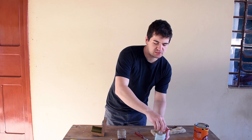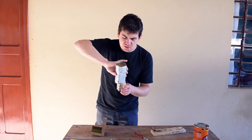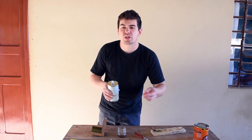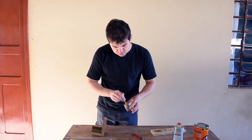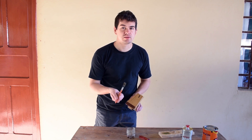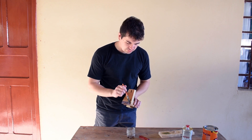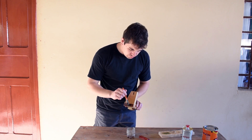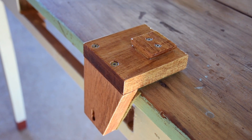We're going to apply the second layer of varnish. Now I'm using just around 10% of solvent. In Brazil we call that 'Água Ras,' but it's probably exactly the same as white spirit or mineral spirit — the name can change depending on where in the world you are. For a better look, you should pass the brush in one single stroke. Now I'll let it dry for around one day, then trim the rest of the felt, and it's ready.